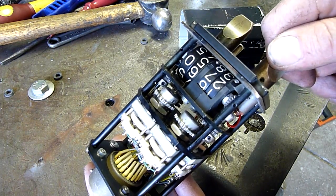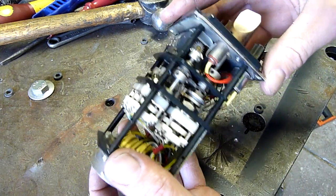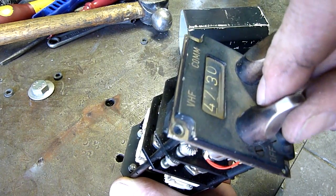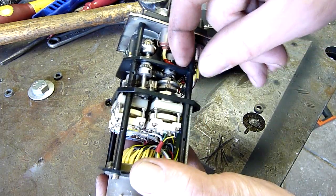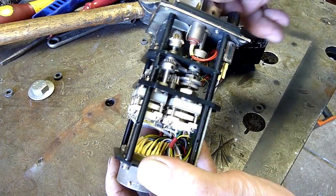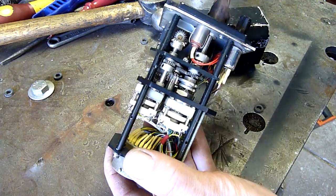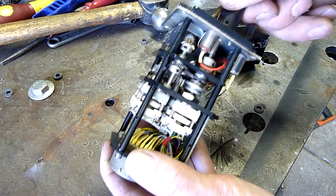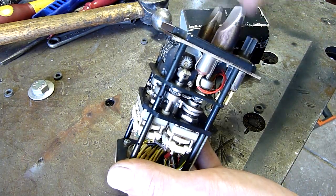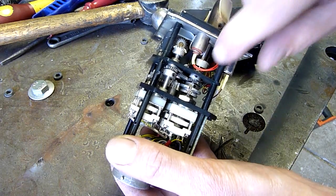This one will not go past 149, and going all the way back it won't go past 113 - because these little cams behind the lamp wires move sequentially, and once you get to a certain point they all come together and lock up. So this is actually set as far as it can go - it has a fixed channel range. You cannot go past that without internal modification.